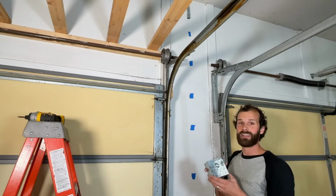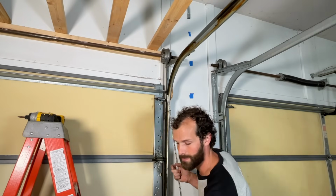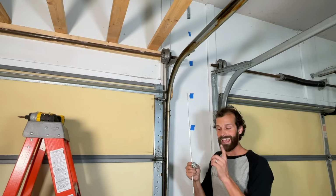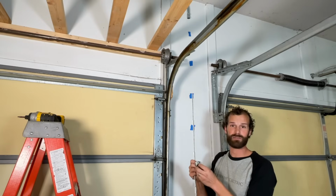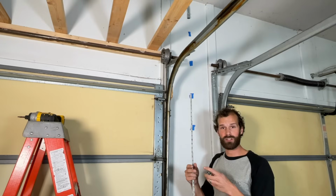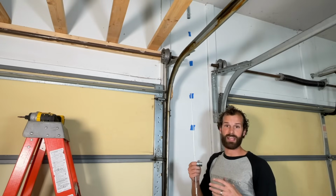And then, here's the pro tip. I'm going to deduct another 1/4 inch because I'm going to lose a little bit on the shoulder of the fitting and I don't have to be absolutely full depth. I'm going to give myself a little bit of grace, that 1/4 inch of play that'll really, by the time I deduct for the shoulder, have about an 1/8 inch of play.